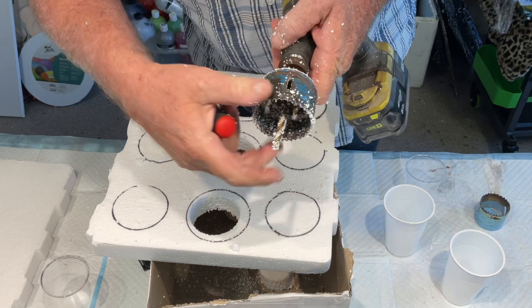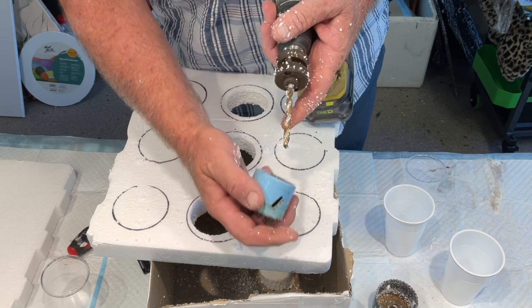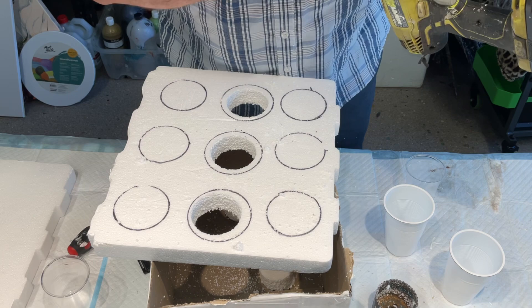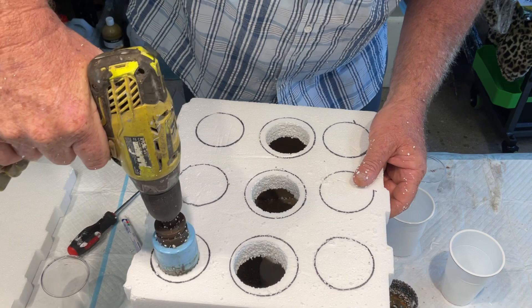To undo the hole saw again, we pull that out — it's got two pins there and then it's nice and loose and just spins off. Here are the holes for the locating pins. This is for the smaller one — it's got the locating pins and you just screw it on until it touches, then back it off a bit, push the locators out, turn it backwards until it locates. Just got to be careful not to push too hard and break the foam when you're drilling.